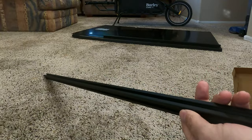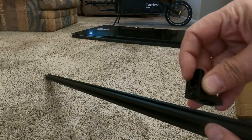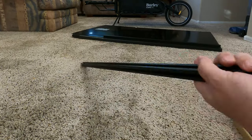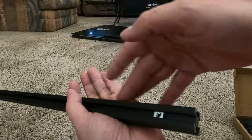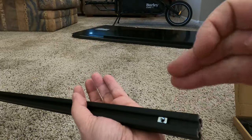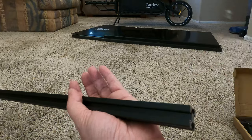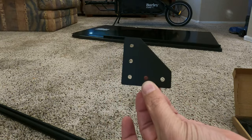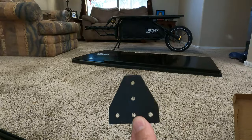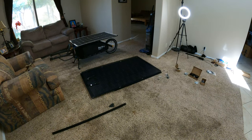For this project I have quite a few connectors. The quarter-type connectors channel in with teeth that can be broken off as needed. The little T-nuts slide into the slot and the bolt connects into them — you want to preload everything and think it out before assembly because once installed you can't get them into the slot. There are also smaller T-nuts that drop into the slot, and corner brackets for a more secure joint. I also have T-connections to size up the rails and make the framing to attach to the trailer.